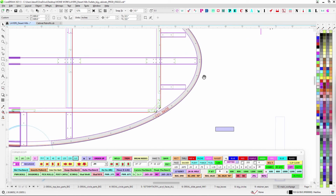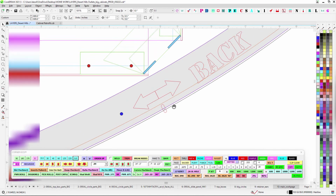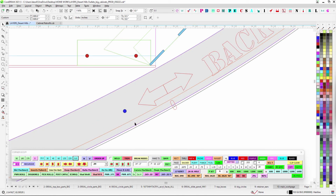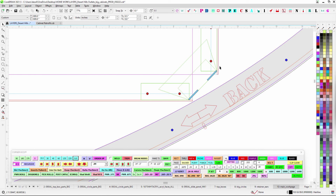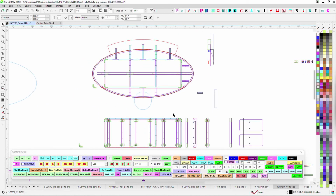Let's see. Oh, the seam. You're going to have a seam right here, which is going to be 3 inches with nothing. I'm saying that it'll be okay because these things will be up so high that if you were to just cut a square of 050 and just lords it right across there, keep it back from the edge so nobody sees it. I think that would be enough to stabilize that, and nobody's going to see it from the street. Your boxes start right here, so it'll be well hidden. You can't really do anything out here. And maybe inject some lords, and then when they bondo that, that'll be nice and clean. So that'll be nice and stabilized.